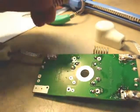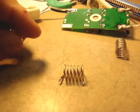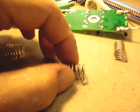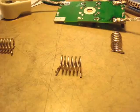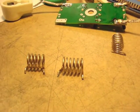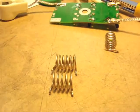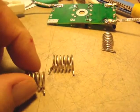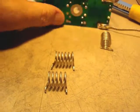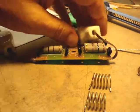So again, what we're going to do: this is the original coil — it tends to get too close to the operating frequency of 10 meters. And this is the modified one. You can see them side by side. It's just a matter of removing one turn, and then you'll have to spread it out to fit back in the board.